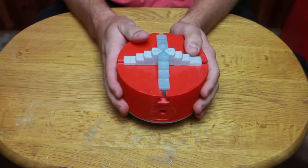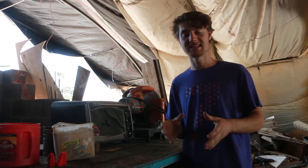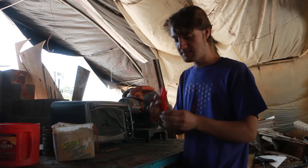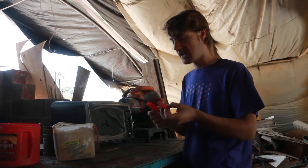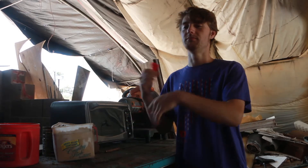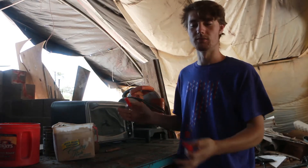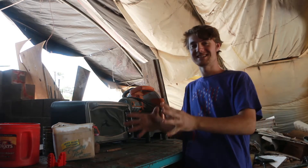We have the chuck 3D printed and we have our pieces, but now we have to build the mold for the casting of the piece. These are just test pieces — these aren't the original chuck pieces yet. I will cast those, but I want to test them first and test the ideas out to ensure that they work before I go through and cast the whole part.